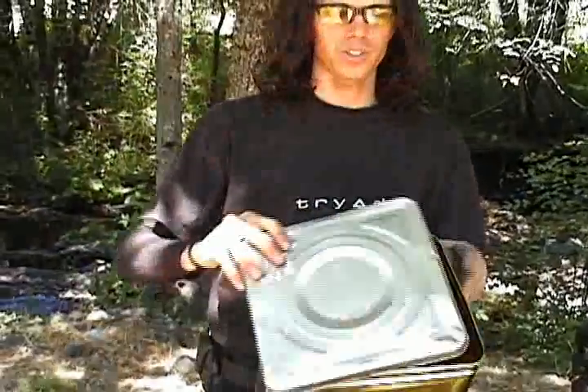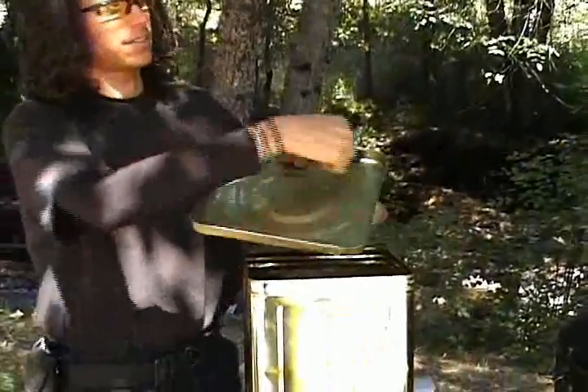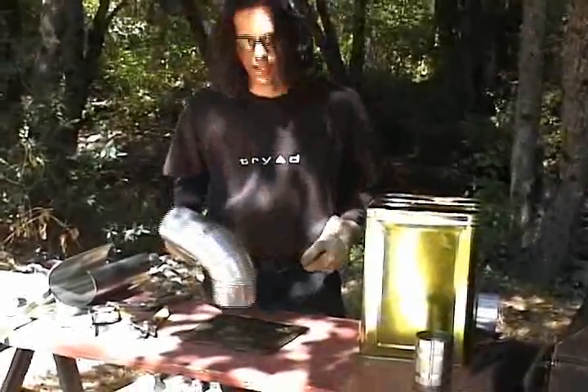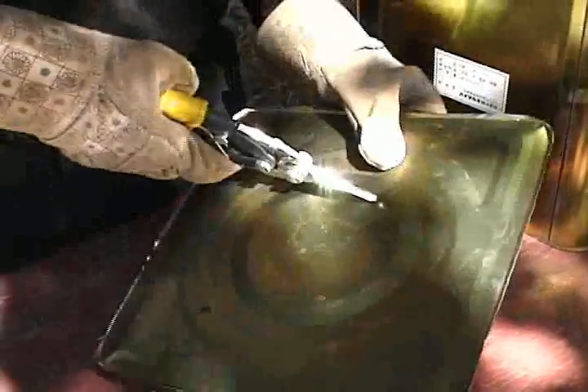With this kind of lid that goes over top of it, what we're going to have to do is cut the outside edge off. You'll need to take one of your pieces of stove pipe out — in this case, we're going to use the front of the elbow. Lay it down on top of your lid in the center and draw a circle around the edge. In our case, there is already a circle here. Once again, take your chisel and hammer to start the hole, then take your tin snips, put them in, and cut around it.